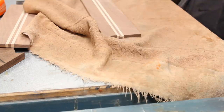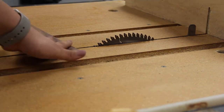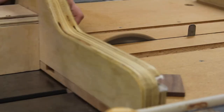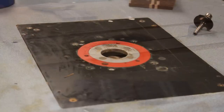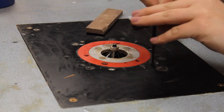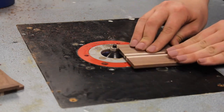You don't have to treat these like cutting boards — all I do is just sand them with 80 grit and then go to 120, and then wait to do 220 grit after I actually have them all in their squares. So I'm just going to use my crosscut sled here to cut them to three inch square because they're already three inches wide. As you can see, I'm just measuring here with my cup to make sure that I have enough for three to go on each of the pieces that we've cut. You can definitely use a chop saw to do this, but I really just like using the crosscut sled — I feel like the cut is way cleaner. I already have three made and then I'm just going to measure exactly the same way with the other piece of wood. So overall we got six coasters, and now I'm just going to use our router with a chamfer bit. Make sure it's not too much of a chamfer because this is super thin as it is — make sure you have a thicker coaster.